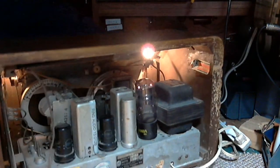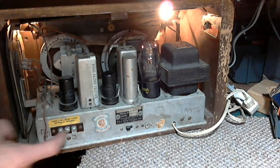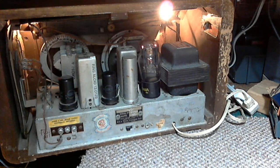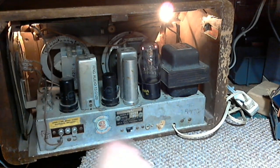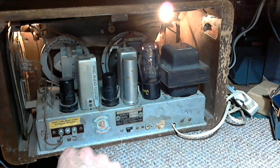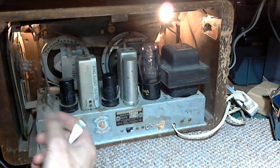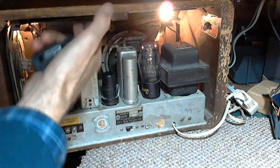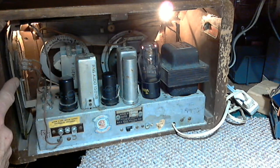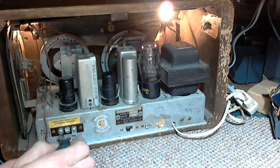Now, on the back of this radio is an antenna link. Right over here. And it says, open link when using external antenna. So the link is open right now. It had to be open for some of the alignment things we were doing. Link is open. And this goes to that funny piece of wire, basically, that's looped around a little bit. It's just up here. The actual antenna is here. So my question is it using this antenna? So first, let's remove the wire antenna.